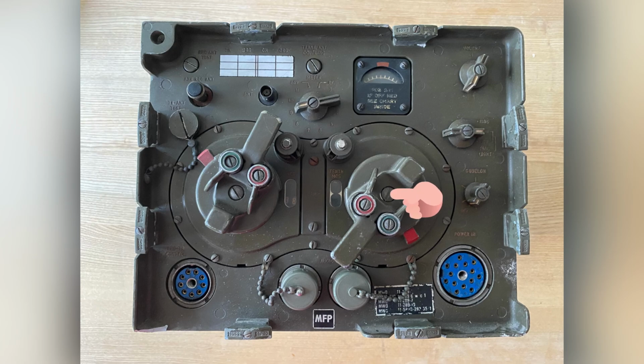The right big tuning knob serves a VFO to tune the desired signal within 1 megahertz after 2 variable IF stages. A second oscillator stage and a second mixer stage bring the signal to a second IF of 1400 kilohertz, followed by 2 IF limiter stages and an FM discriminator with 2 valve diodes, 1A3. The transmitter frequency is controlled by a special discriminator that compares the transmitting frequency to the receiver frequency. The 2E24 transmitter PA has a special quick ready filament and is only heated on transmit mode.